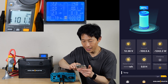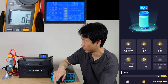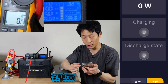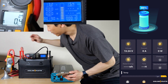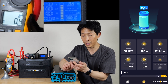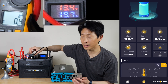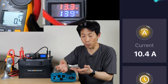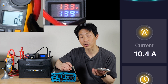In the app, I can't actually click on anything — it just shows one page of all this information. I'm going to turn off the load now. I have a lithium iron phosphate charger here. Notice in the app the discharge state is turned off now because we're not discharging anymore. Let's see if the charge state turns on when we connect this. It's charging at 20 amps. Right away the charging turns on and it says 19.1 amps, 257.9 watts, and it'll take another 1.2 hours to fully charge from the current state. Let's modulate the charging speed to 10 amps only — and in the app it says 10 amps also. This is a very nice way to remotely monitor your battery pack, especially if it's installed somewhere hard to access.